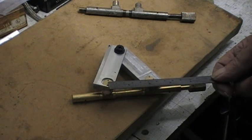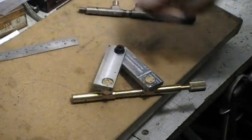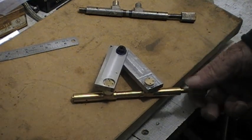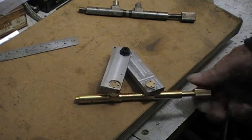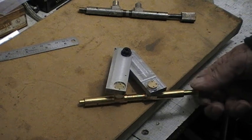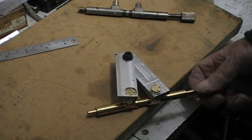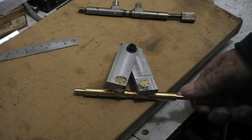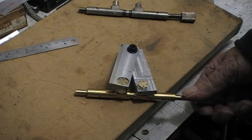The centers once again are 54 millimeters, so they're the same as the previous. Returning in a right-hand direction now, you can see that the arms are closing in. That's giving the adjustment that's necessary to get the width of each part of the binocular to suit the person's eyes viewing through the lenses.